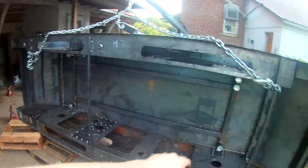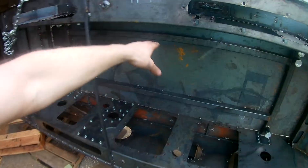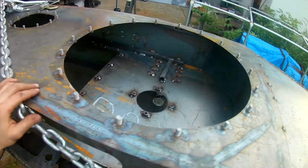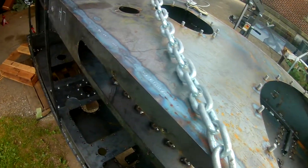From a parallel standpoint I'm only a sixteenth off. Corner to corner I'm only an eighth inch off. And from a 90-degree standpoint, I'm about a sixteenth off from the bottom to the top from a width standpoint. So I was pretty happy with those tolerances, and I decided to just stitch everything together and start to do the final burn off to make things nice and watertight and structurally sound.